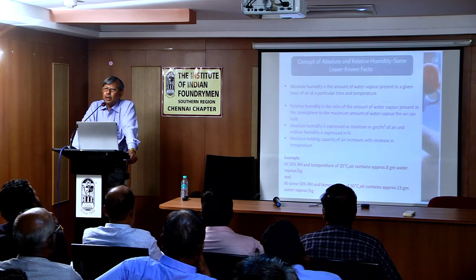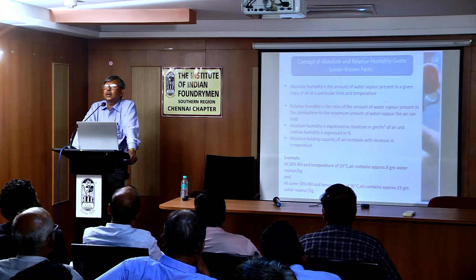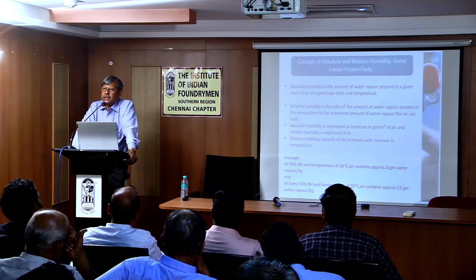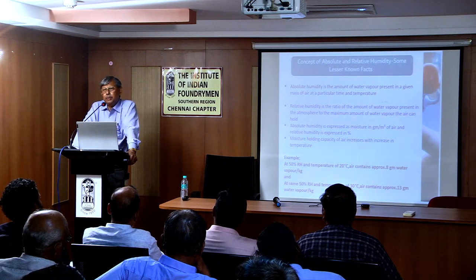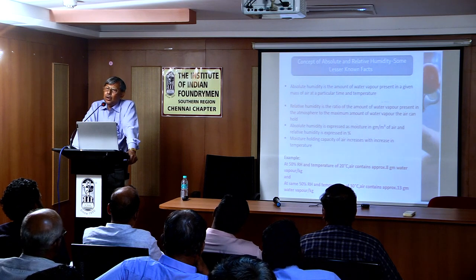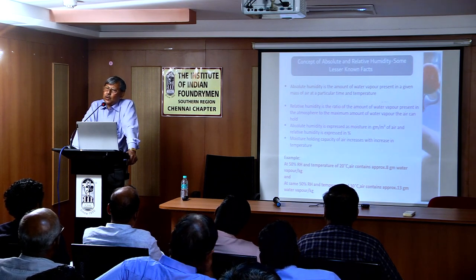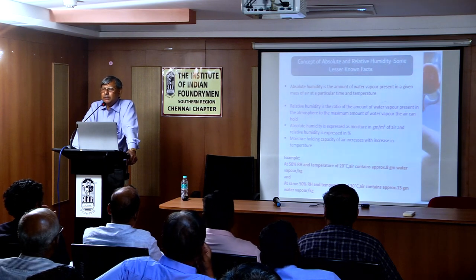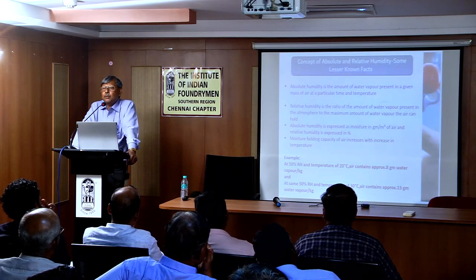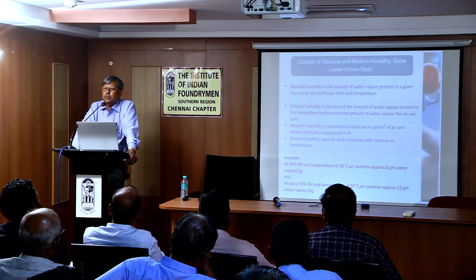See, the thing is that you are practicing foundrymen, and you have been using the cold box system for more than one decade, two decades, three decades. People of my generation must have been using it for four decades, and now it is one decade. Everybody knows that humidity reacts and takes a toll on the strength properties. But how many foundries have specifications for acceptance based on humidity?